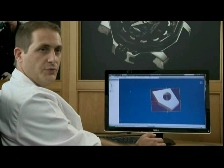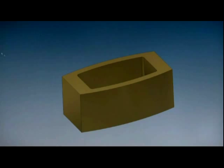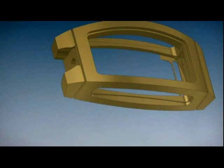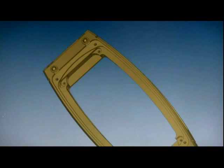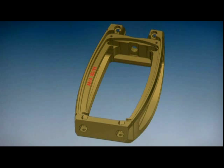For the design of the case middle, the first step involves extrusion. This enables us to create the shell of the part, something that's quite close to the design. From there, function by function, we extrude the sides of the part, and slowly, function by function, we build up. We form the different shapes of the part until we end up with a piece that has the design that was chosen and is technically complete.